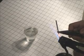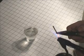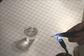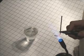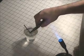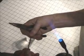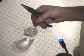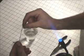So now we have a heated blade. We slowly bend it. So we have a 90-degree angle. Once this is as hot as we can make it, we dunk it really, really fast. That will make the carbon steel very rigid and perfect for our purposes. The options here are to do the opposite on the other side, have a double-ended wrench, or what we're going to do now is make a twist flex wrench,